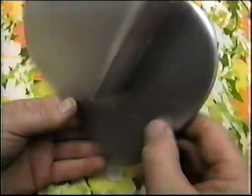And what I wanted to show was, and we had worked on these previously, you could still see the seam, but not to worry. The trick now is another wet sanding, and I'll do that off camera, and another coat of silver. And next time, I'll go back over this 2 or 3 times with some extras. In other words, I'm building up what I call a skim coat right on the seams. These are so light. If I just used heavier wood... The reason you see the seam is the seam is hard and the wood around it is so punky soft. But we'll get that seam to disappear before we go to the next step.